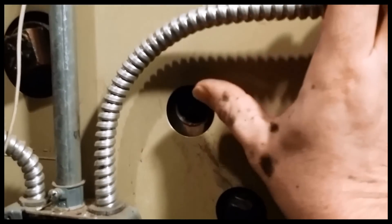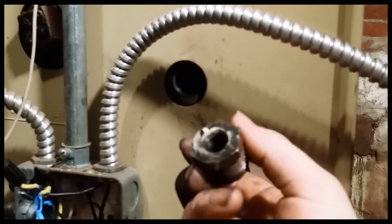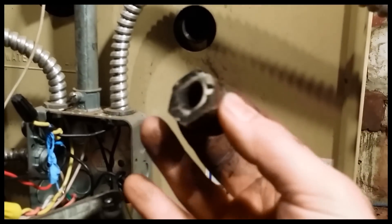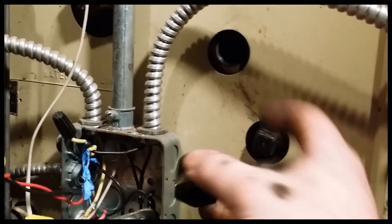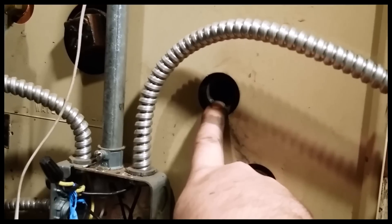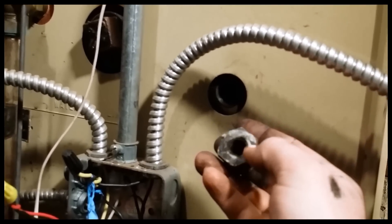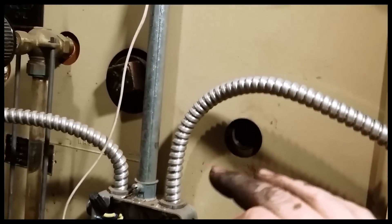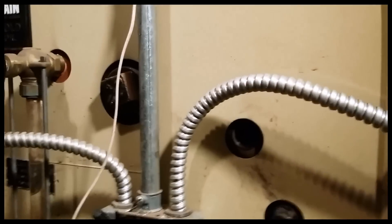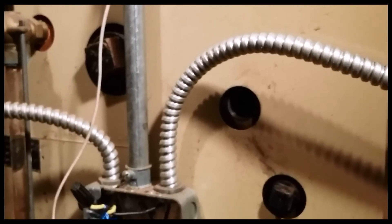This is where we're at. We actually took the bushing out of here. An inch socket doesn't even fit on this — we had to get a monkey wrench. We're going to take this down to see if it's inch or three-quarter NPT. I'm going to try to save it, but I don't want to use it. What we're going to do is instead of having a quarter inch here, we're going to cinch it down to a half inch instead. We'll put a half inch fitting, curly-cue some soft copper up to another half inch fitting, and build our cut-in and pressure gauge from there. A nice big copper pipe will be less likely to get clogged than that little guy we had down there.